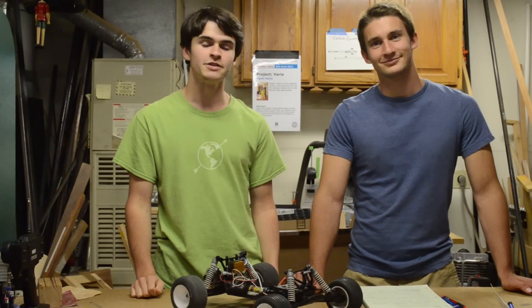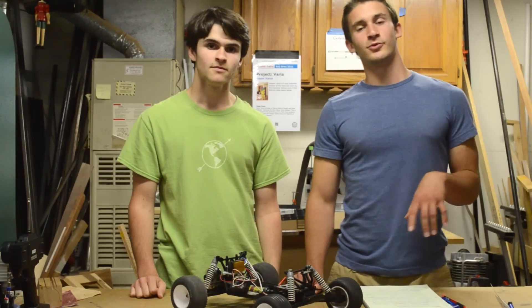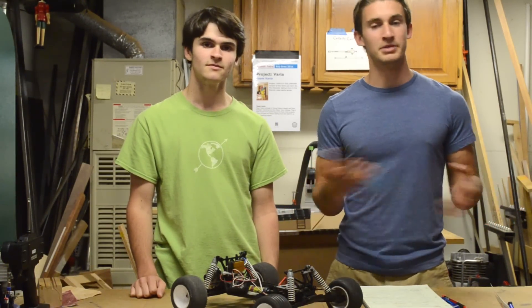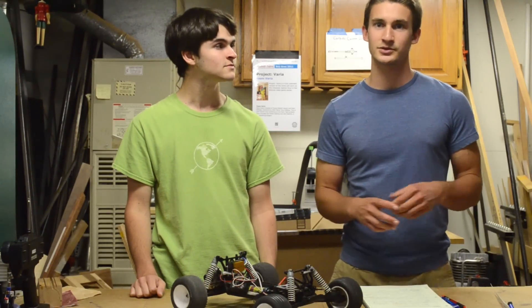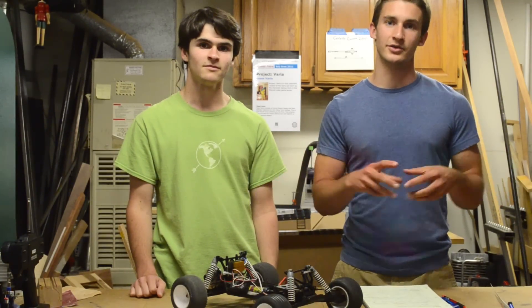This week we'll be talking about servos, since they're an essential part to making things that involve motion. Specifically, servos are used to control the orientation or position of the moving part. A servo is basically a term for any system that has three parts: the first is something that moves, so that's either a motor or a piston; the second is something that can sense that motion, so that's like a shaft encoder; and the third is some type of control system that brings those previous two parts together.